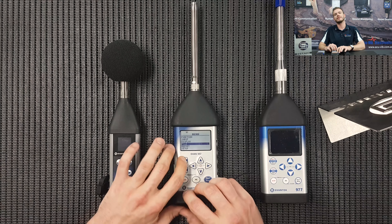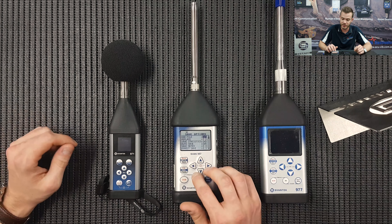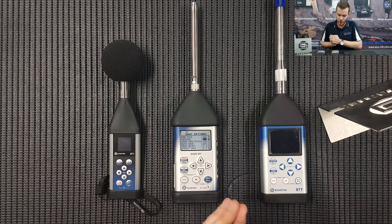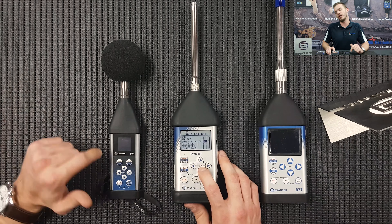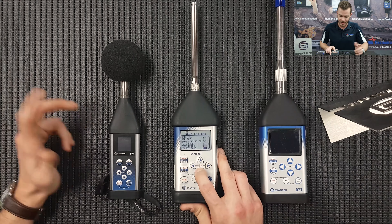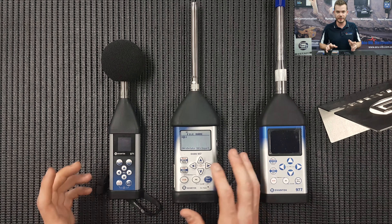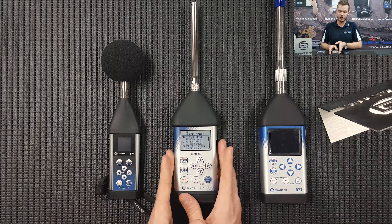In the 9.5 series, that takes us to Files. This is one of the crucial parts with the 9.5 series — there is an auto save option. Move to Save Options. Take note for the 9.5.5, 9.5.9, and 9.5.7: this is essential to save logging parameters. We will have a result file but not a logger file unless you click on Auto Save and tick it on. I'm going to tick off RAM file because we don't use that so much. Save Statistics — for environmental logging: L10s, L90s, LNs — this is where the statistics will come in. Direct save, save meteo station — we don't do too much of that. Enter to save. It's going to ask you to name the file — once again, keep it simple and don't use too many characters. Enter to save. Free space on the instrument will tell us how much space is left. In the 9.5 series we have 30 megabytes of data — 15 megabytes split into result files (your statistical data summary results) and 15 megabytes based on logging data such as time history and weekly data.